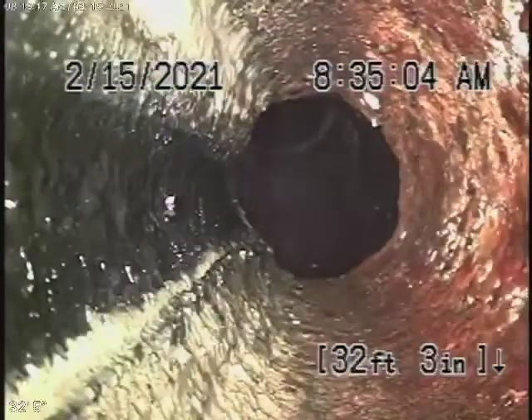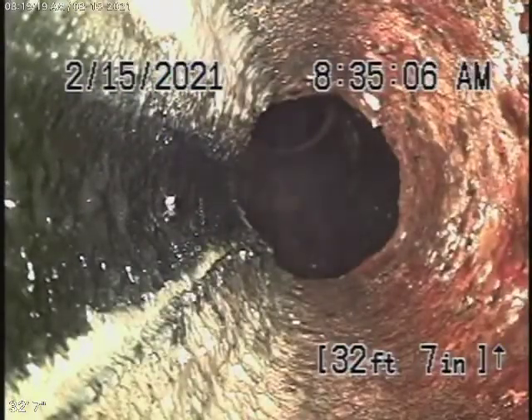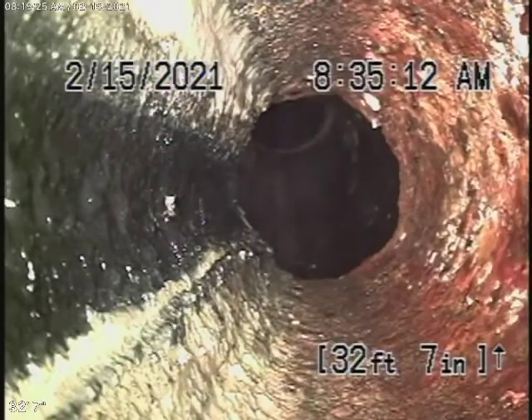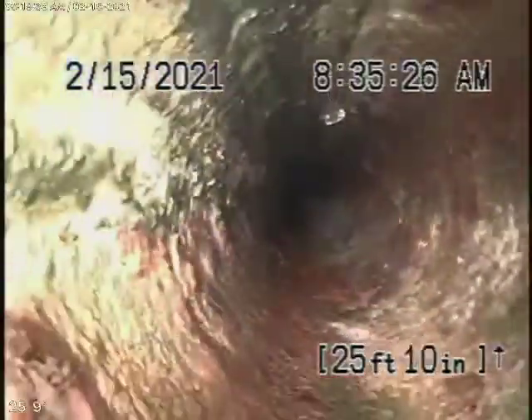Right over here is where the pipe exits the house — it's about two feet deep near the water shutoff valve. It comes to a cast-iron pipe, which starts coming underneath the house. Looking at the inside of the pipe, it doesn't look too bad at all — very minor rust build-ups, and the pipe is pretty nice and round.